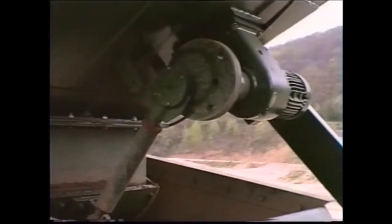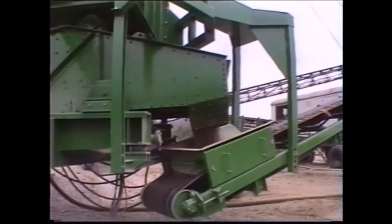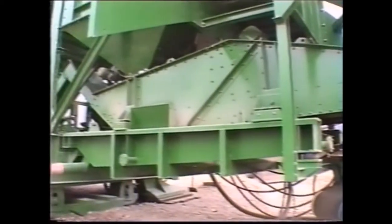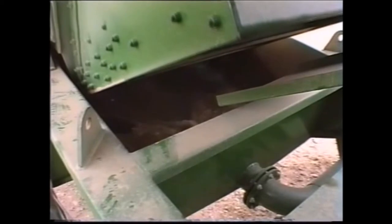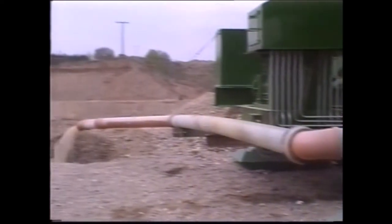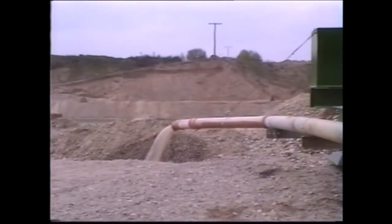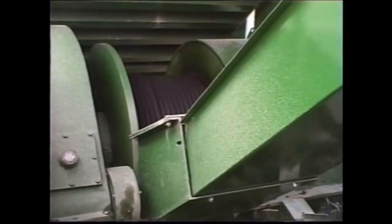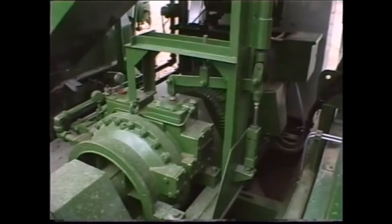Here's the dewatering screen with the reciprocating feeder again. Depending on the material and the required throughput, the size of the screen and its apertures, and the dwell time of the material on the screen can all be harmonized to attain the lowest and most economical residual water content. Fine sand, washed out with the wastewater, is fed back into the scraper track. The in-haul drum is equipped with cable grooves on the patent Le Bus system, ensuring clean winding and hence long service life.